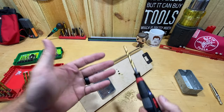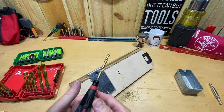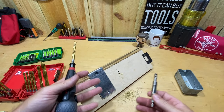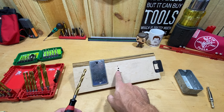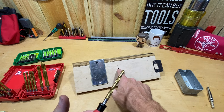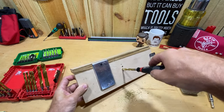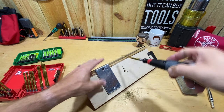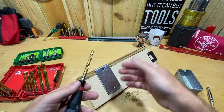Small drill bits you could do that for, which is primarily what I'd be using this screwdriver for anyway — small screws. I think it's pretty nice that maybe I could put in a small bit and pre-drill holes for things like my strike plate or door latch. I did the 7/32nds and the eighth inch fine; the 5/16ths is where it started torquing out on me. I got pretty much most of the way through — probably at least two thirds. I finally got through it, so I'd say you wouldn't want to go crazy big on the drill bit. That's probably as big as you'd want to go, and you'll have to play with it going back and forth to get all the way through.